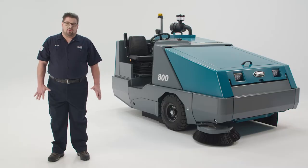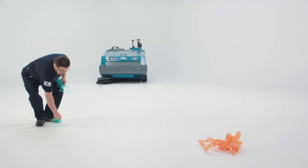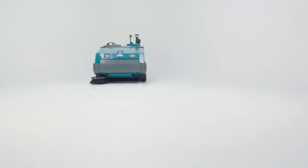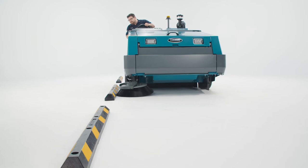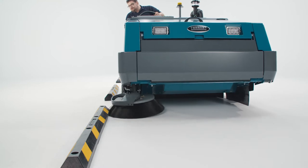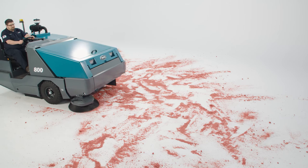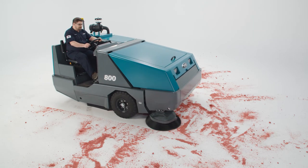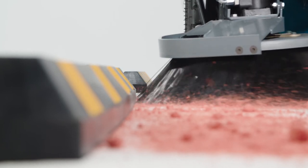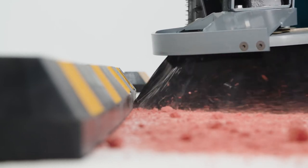Now that we've gone over all the controls, let's get ready to sweep. It's important to pick up debris like pieces of wire, string, banding, or plastic wrap, which could become entangled in the brush before sweeping. Also, it's best to plan your sweeping in advance. Try to arrange long runs with minimum stopping and starting. Sweep debris from very narrow aisles into the main aisle ahead of time. Do an entire floor or section at one time. Sweep as straight a path as possible, avoid bumping into posts or scraping the sides of the sweeper, and overlap the brush paths. For best results, use the correct brush type for your sweeping application and consult your operator manual for recommended applications.